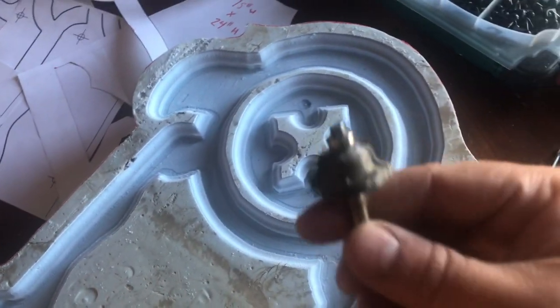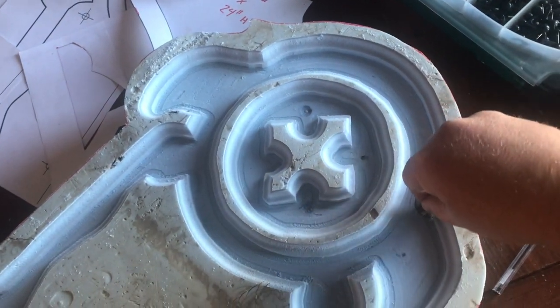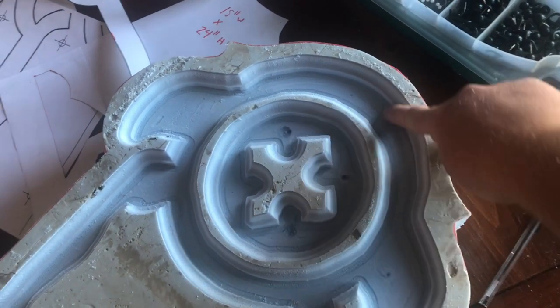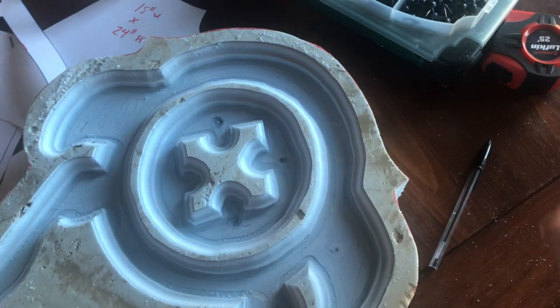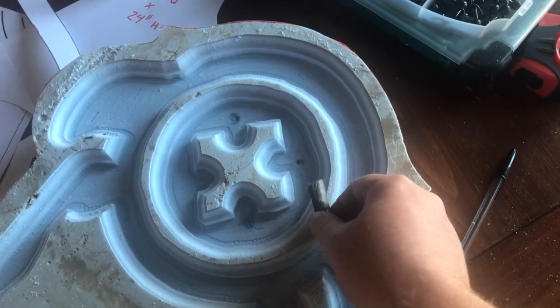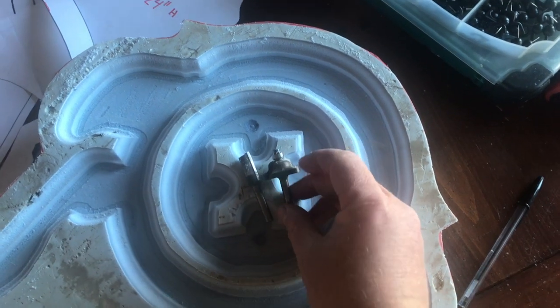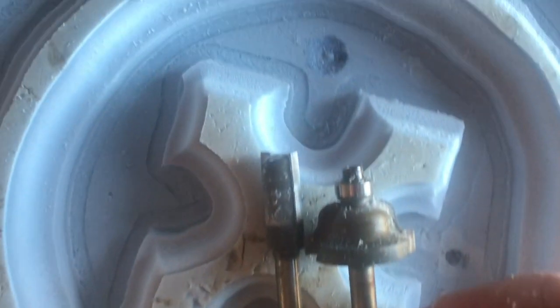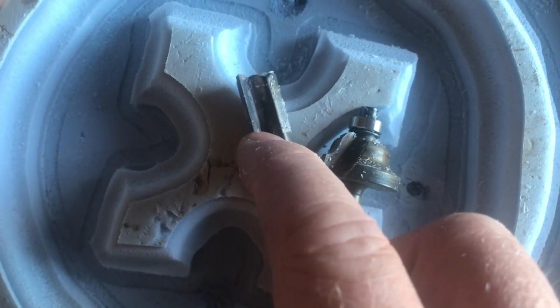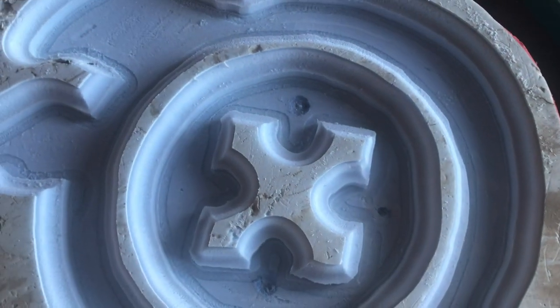Now once you've got the whole thing routed you want to get a 3/8 inch cove bit with a bearing on it, and this is really important because what the bearing does is it allows it to sit on that edge and roll around the entire area so you get a perfect level of routing all the way through. When you do your depth, you want to compare it to your cove and you want to make sure that you set it enough to allow enough room for this cove to go in. You can see that these two bits are so close to each other but they leave that little bit of a difference — if I just got a little bit deeper with this cut I wouldn't have ended up with these little tiny worm lines all around. Since I'm covering this in acrylic polymer grout you won't see it anyways.